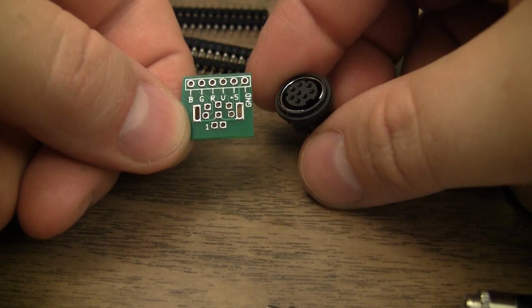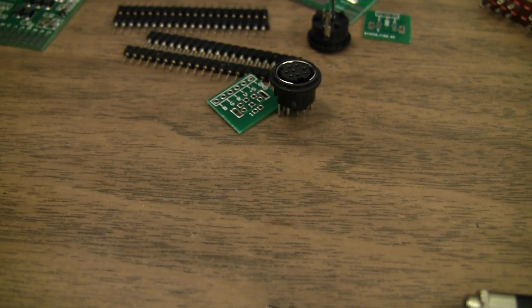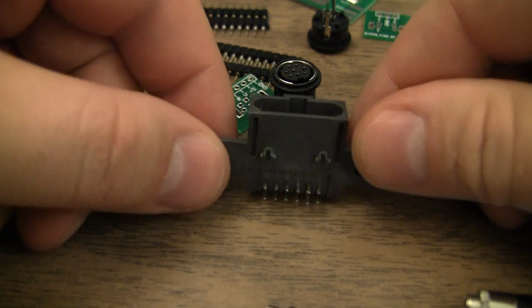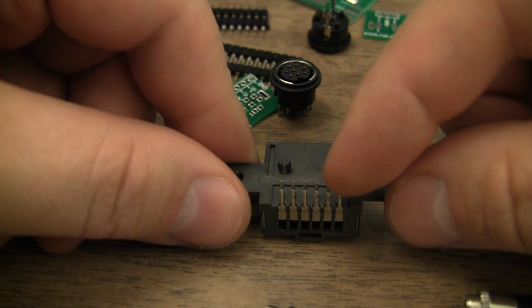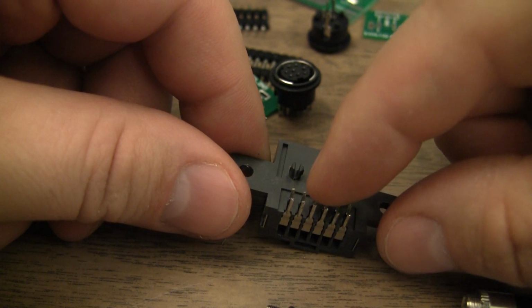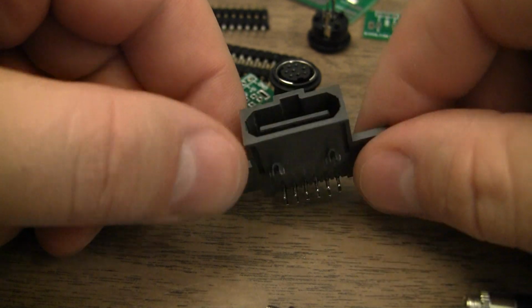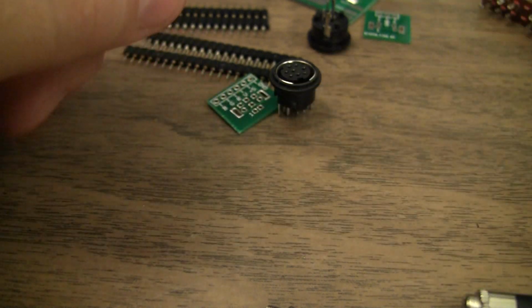Like the one that I plan on using a lot is the SNES multi-out. This one is ideal for Nintendo for a few reasons, other than it has a lot more connections. It's got RGB, sync, 2 ground pins, the 2 pins for S-Video, and a pin for video, a pin for 5 volts, and then a pin for right and left audio. So for that reason, this one's probably going to be more popular in the US, and we can get SCART cables, Euro type SCART cables for these real easy.